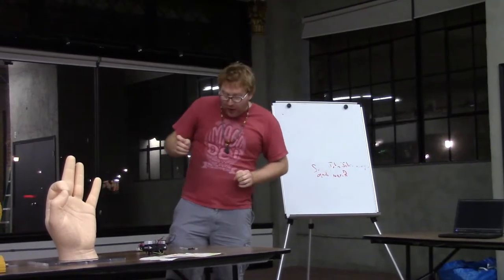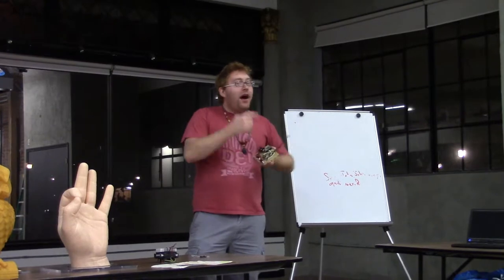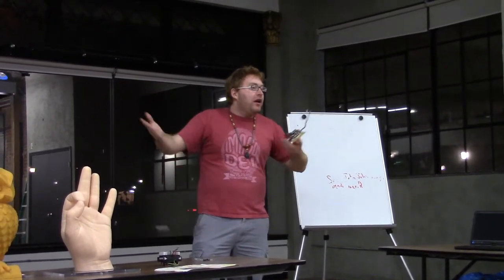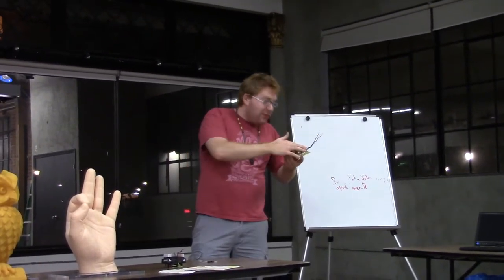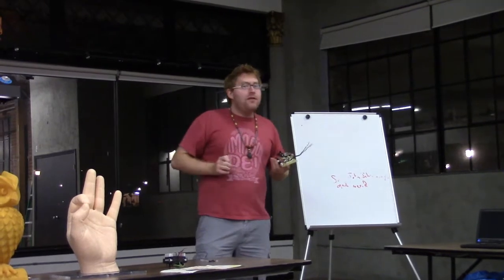So what I found out is you actually need a constant current controller, which is this little guy here, to make sure that the current is regulated so you get the same light output, and who cares what the voltage is across them, you've got the right current going through your LEDs. So after playing with this for quite some time and doing a lot of soldering and quite a lot of math, I got this hooked up.